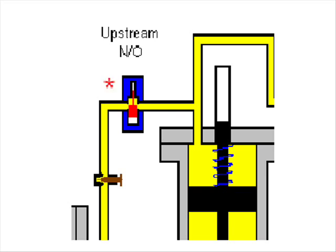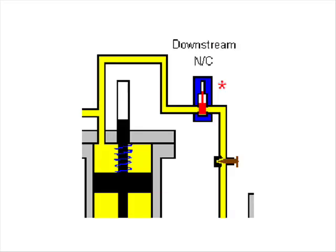To maintain a flow rate or increase the flow rate, the solenoid has to be energised. Whilst the upstream solenoid is energised, the downstream solenoid is pulsed. This reduces the pressure above the piston by allowing the product through to the low pressure side of the valve. The high pressure product under the piston then pushes up the piston and opens the valve.